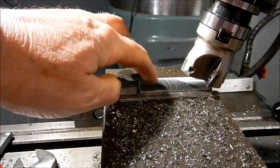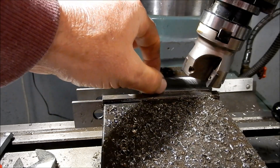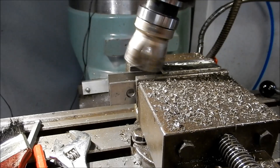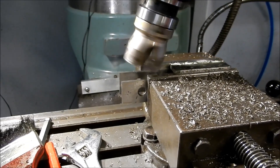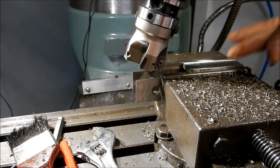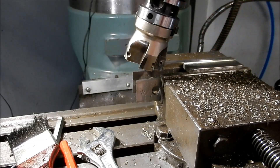That's exactly 1.6mm, and it's down to a feather edge there. I'll just give it one more clean-up lick back this way, and there it goes. That's it - done. That's a very nice surface finish on that too. We'll get this out and show you.